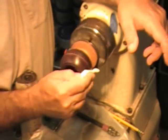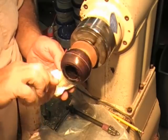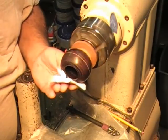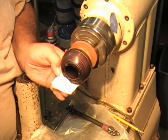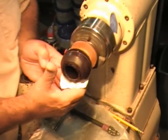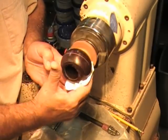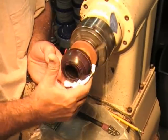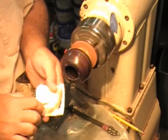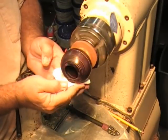Now let me tell you what happens. The shellac is a natural product. You cut it with the denatured alcohol just like the manufacturer did when he blended it — he took the wings of the lac beetle and cut it with denatured alcohol to a mix. The boiled linseed oil is a natural finish that's been around for hundreds of years. It takes a long time to cure, but you're not using it for the finish qualities — you're using it as the vehicle to polish the shellac and bond it in. Do you see the little shininess I'm getting? I'm just going to keep buffing this in and working it in.